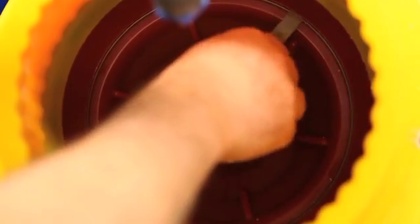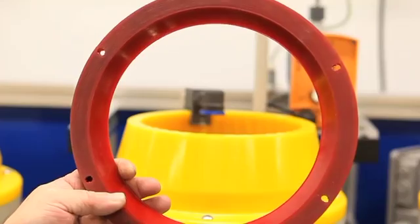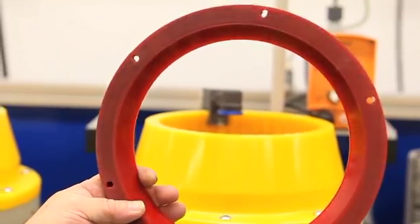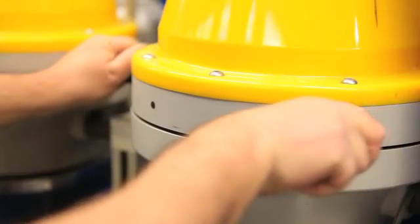This gap is where the wet abrasive effluent flows out of the process chamber. As this gap will eventually wear, the polyurethane wear ring is made to easily be replaced in a simple 10-minute operation. The accuracy of the gap is facilitated by an easy twist adjustment system.